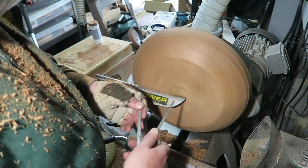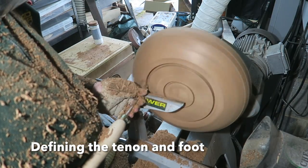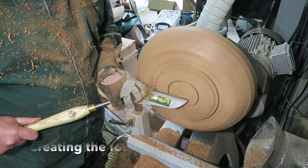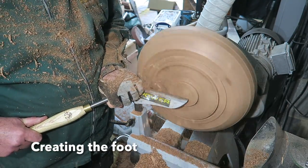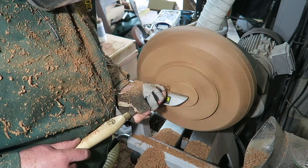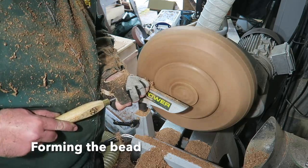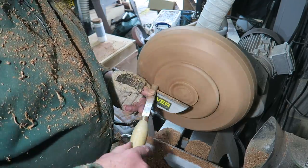You get a lot of these sort of flakes. I'm marking a tenon on the bottom which I'm just defining with a parting tool. I'm also making another groove here because this bowl is going to have a foot. I'm now doing push cuts up to my mark made with the parting tool, creating steps — the middle one being the tenon that's going to go in the chuck jaws. Here I'm just shaping the underside of the bowl, creating that dovetail on the tenon, and rounding over the foot to create a bead. I'm using a variety of tools — point tools, even a half inch spindle gouge — just to create that beaded edge to the foot.